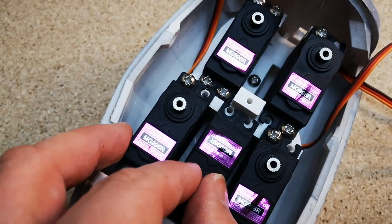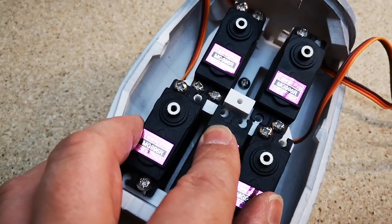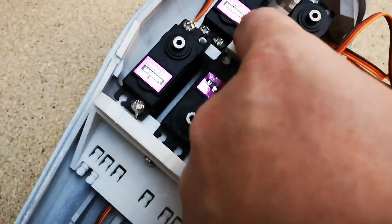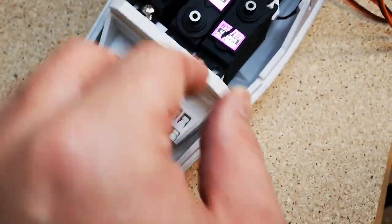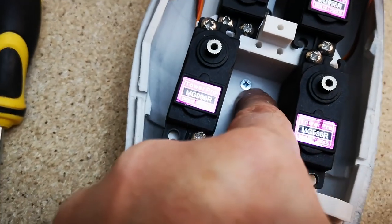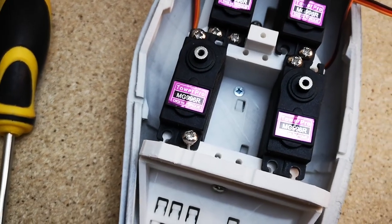But now I've hit another problem, because I believe it's hitting on the screw at the bottom, the screw that's underneath it. So I think you need to use countersunk screws for fixing the bed down. This one's fine because we've got space, but this one down here is going to need a countersunk screw in there, so I'm going to have to try and take that out again. So that's important, countersunk screw in this position here. It should give us clearance to get that servo in.